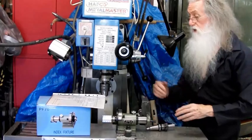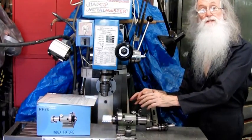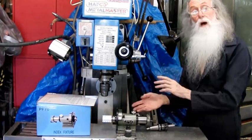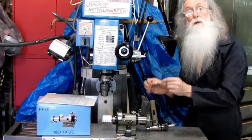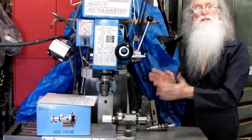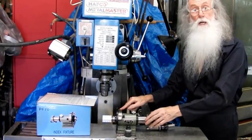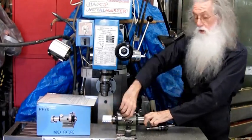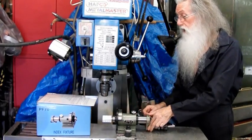Set the drill to zero, wind it back, then index the next tooth. I take a full cut, then I can measure that width, and then I know that I'm right. Yeah, you can try a little cut, and is it right, is it wrong, but unless you go to full depth, you may be one hole out, and you won't pick that up. And if it's wrong, you've stuffed it. So, just index them all the way around.